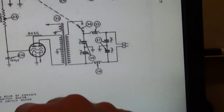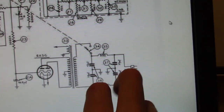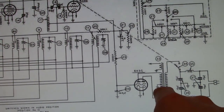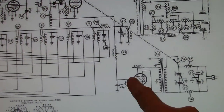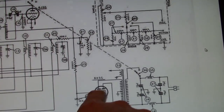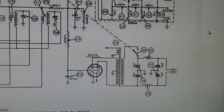Here's an enlarged version of the schematic, and here's that AC line filter — in addition to the usual caps across the AC going to ground, there are some inductors and more caps. I've seen this before on vintage test equipment; it's to really filter out noise from the AC line. The rest is fairly straightforward. It's definitely AC powered only — no battery. We've got a center-tapped secondary for the B-plus supply. And there's the filament supply using a 6X5G rectifier. They used the 6X5 because it has a separate cathode from the heater filament, so you can use the same heater supply as the other tubes.